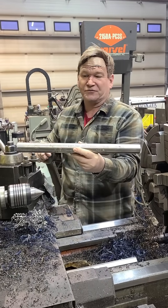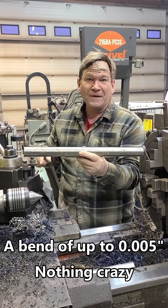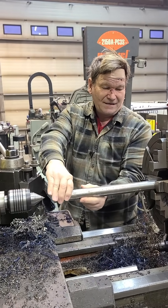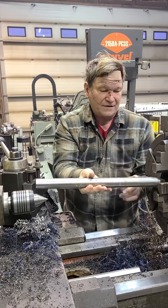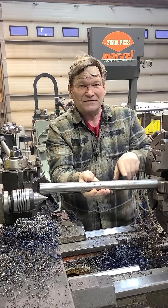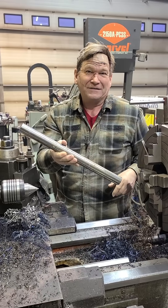Let's think about something else here that's a little strange. Let's say we have a curve in our shaft — all shafts are not straight when you get them out of the factory. But let's say we have a curve in our shaft and we want to get it straight. We can center drill both ends, put this in the chuck, and turn it down somewhere in here. We can turn it around, leave this way out here — and this is going to run out real wacky — but adjust it off center so it matches with the bend, then turn the rest of it to match that bend. You'll have a consistent shaft with a bend in it when you're done, but it will at least all be the same diameter and blend in real nice. That's not a bad trick.